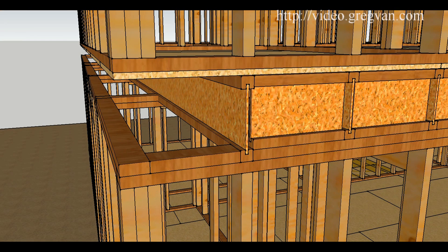The reason I made this video is because someone wanted to know if they could notch the top plate and what it would actually do to the building. They were going to install larger ceiling joists, and one suggestion was to notch the top plate. If you do this on a two-plate framed wall, you would probably be better off putting a stud underneath the joist. Once you have broken the connection in the plate, it will require a strap.